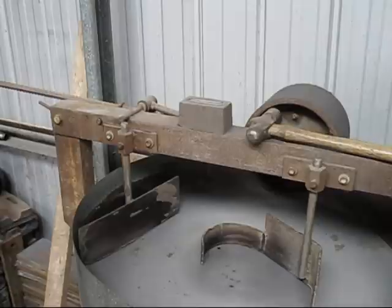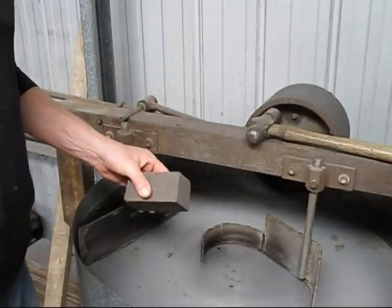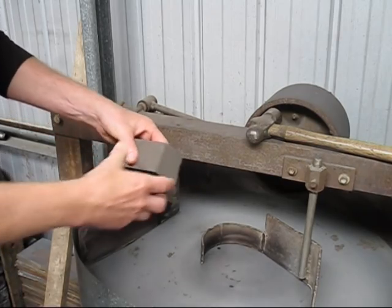This is the third disc brake rotor melt and the wedge test from it. And what happened last time, I used less ferrosilicon and this time I went back to the original amount. We'll see if it's all grey.